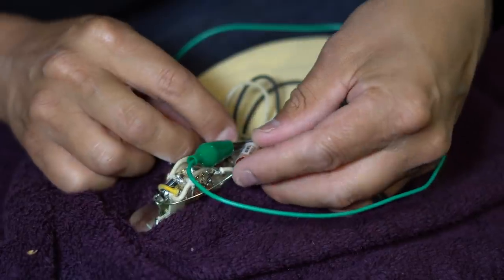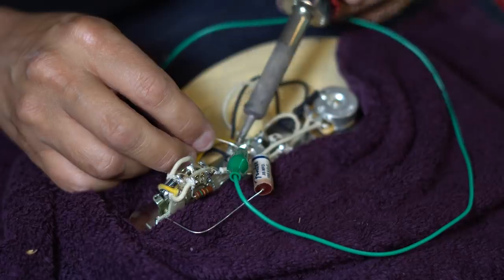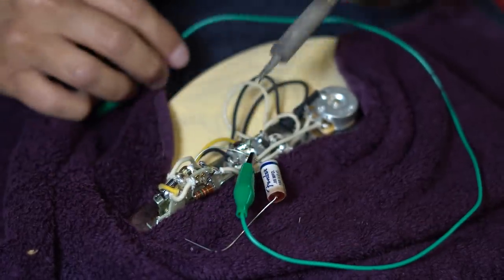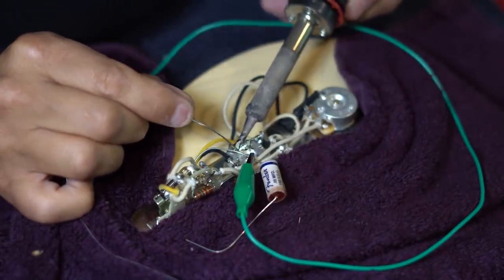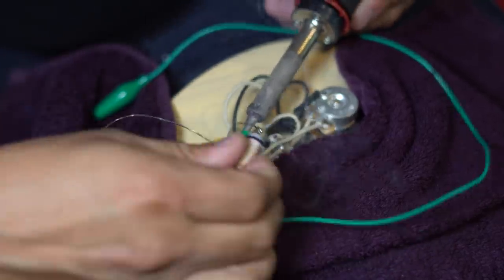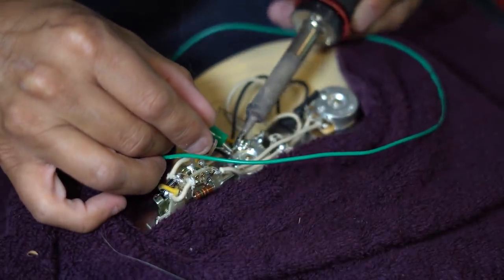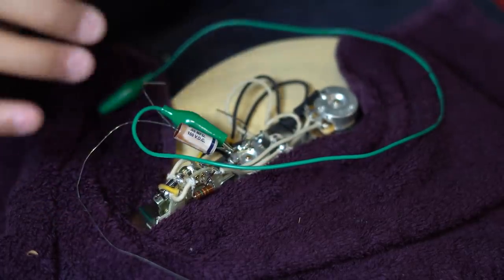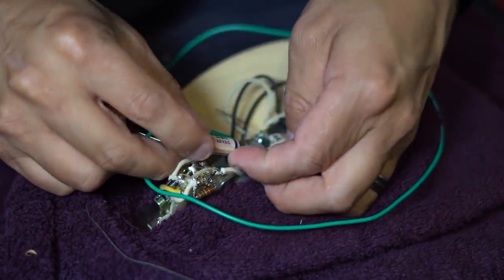The other thing we're going to do to mitigate this issue is preheat the solder so it is all the way hot — a nice pool of solder going before we add the leg. And it was just a touch. I didn't have to do anything. The leg of the cap didn't have to get super hot.